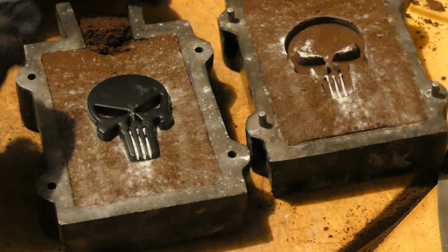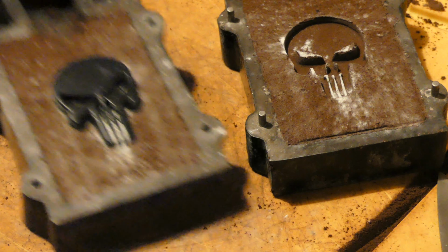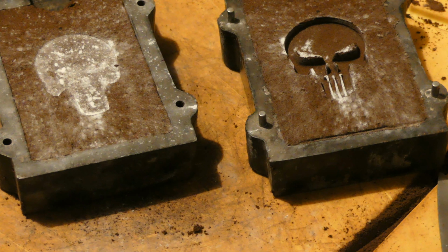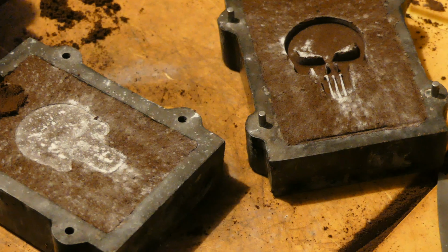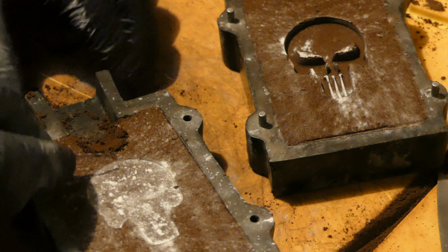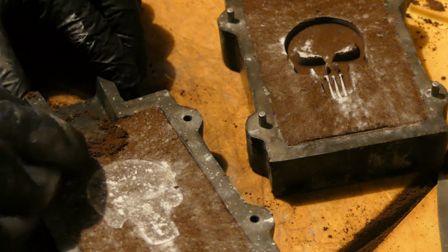So what I like to do though, is you wanna clear out space for the silver to flow in. Gotta remove the mold. Just like that. Just falls right out. So it'll all come in right through there. You want to keep it nice and small so it's nice and neat when you separate it from the stem later on. And this is one key factor in it.